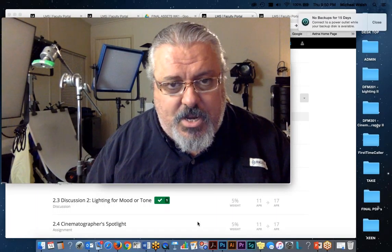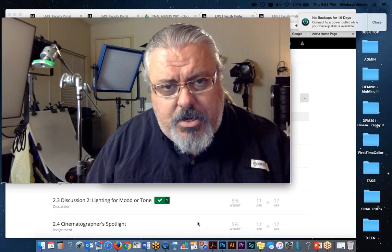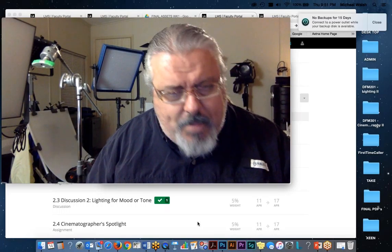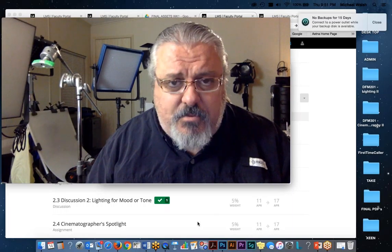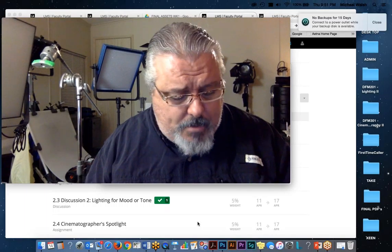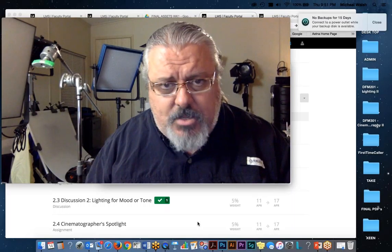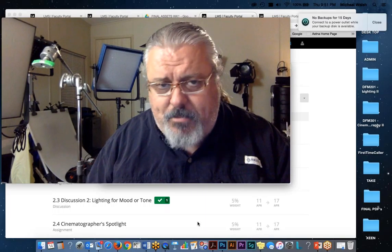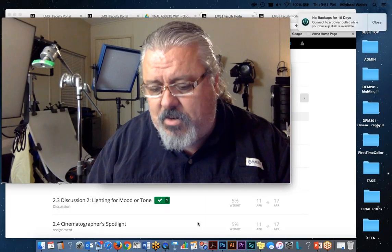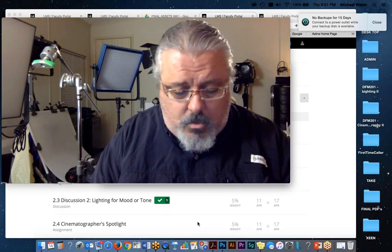The company that makes your fluorescent kit makes an outstanding bi-color one-by-one LED panel — 600 bi-color LEDs, tungsten or daylight. It's another soft source, so it won't give you the hard, focusable, directional punch of a Fresnel. Your Fresnels will be tungsten-balanced at 3200 Kelvin, but if you're shooting inside and set the camera to 3200K, you're good. Having the ability to focus and cut and shape a hard light source is something you'll need frequently in a lighting career.